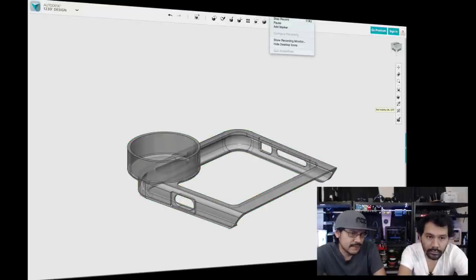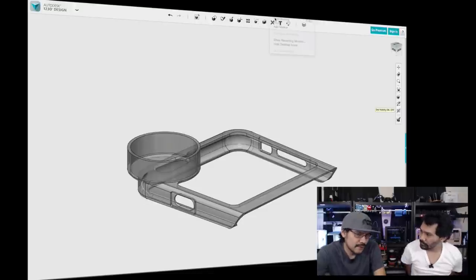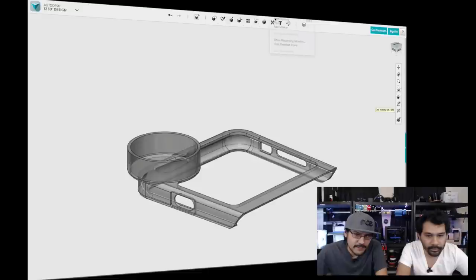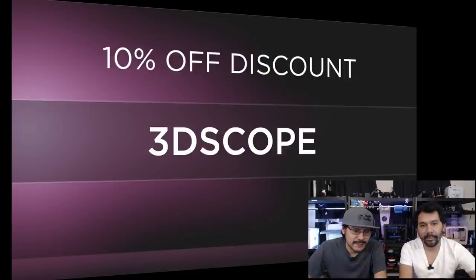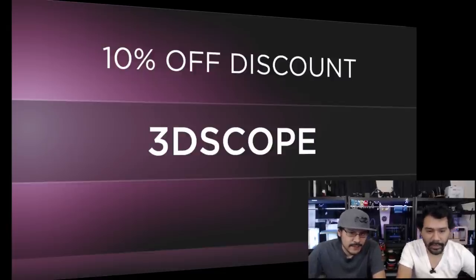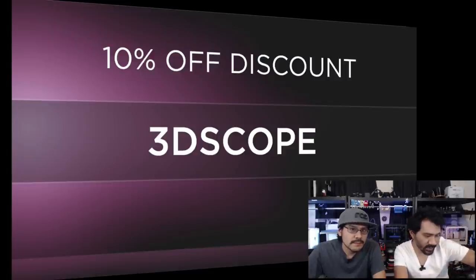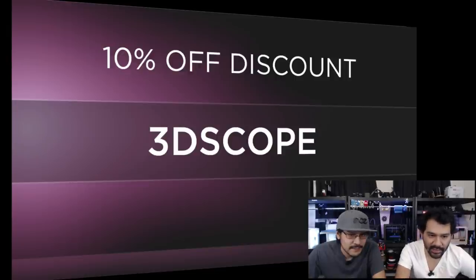Using Simplify3D, I did the auto-generate for supports and then removed some I didn't want around the holes. I also added recessed surfaces for the port holes so you can get your fingers in to the little switches — it is kind of thick on purpose so it holds really sturdy. I uploaded the 123DX files and STLs on Thingiverse and updated the guide. We do have the telescope still in stock — it's a $60 Celestron Firstscope, a really nice telescope. We're at about a quarter moon as we're recording this, so if you get one, you should have it in time for a full moon.